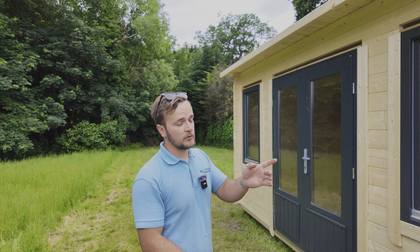Just remember that timber is a natural thing, so you might get a little bit of a bow. That's no dramas, because you can pull most of them out with your hand. Get your bottom architrave screwed in. And then get your architraves for your next window, which is going to be on the same line. Bring that over. Put them on there.